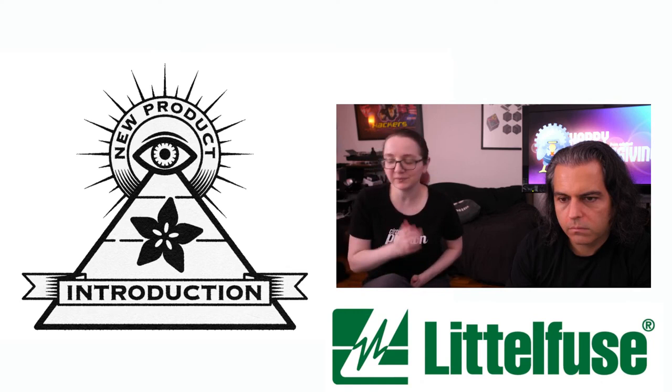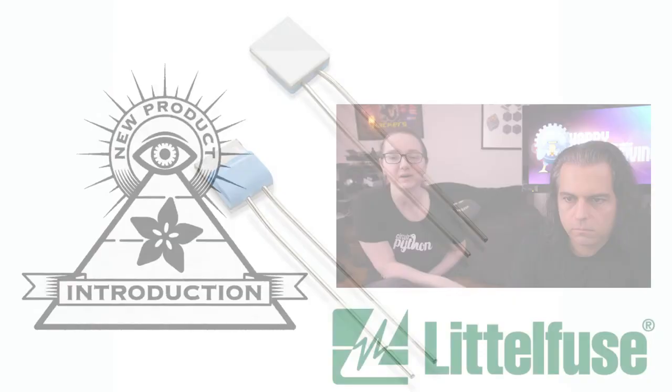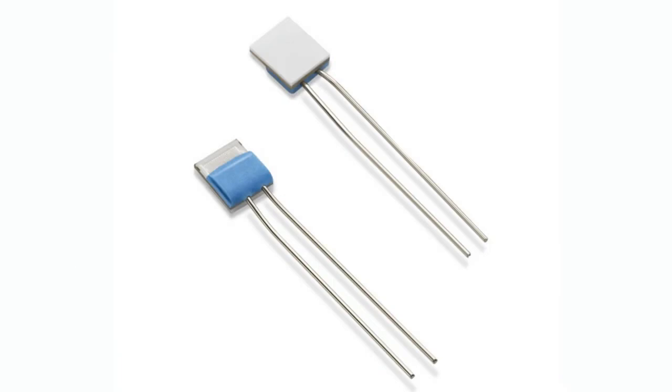Maybe they're saying that they stop these signals. This week's NPI is the PPG-1XXX series of little RTD sensors. These are so small — small chunks of platinum bonded onto the back of a ceramic material to give them strength. There are two little leads that you plug into a circuit; you measure the resistance, and you know the temperature.